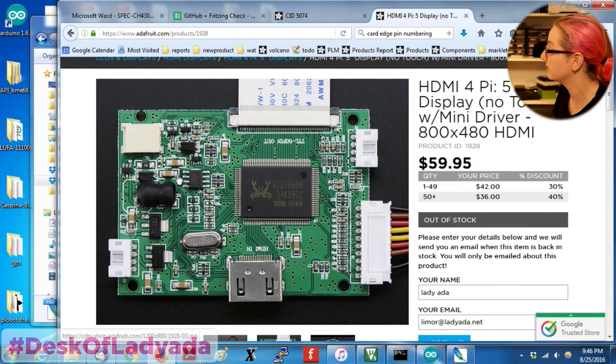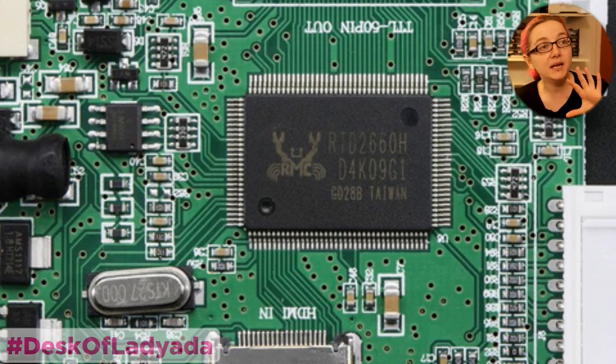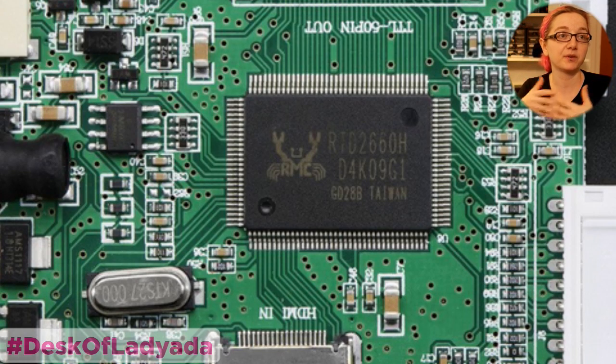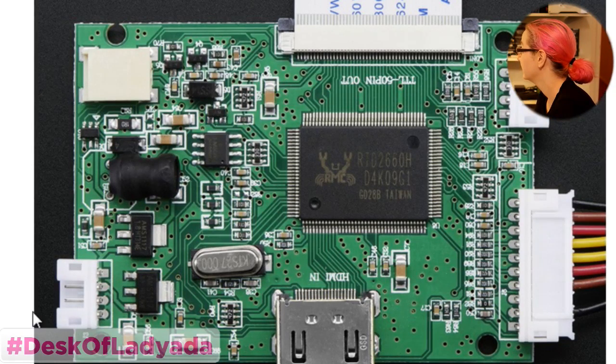You can see here, this is the SPI flash interface, HDMI in. But we want to actually do the full schematic capture of this. And again, there's some pinout information available in the data sheet, but that might not match up with the firmware that we're going to grab off of this chip. So we want to make sure that the board that we make is one-to-one, as close as possible with this one. So here's what I did.